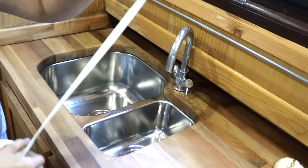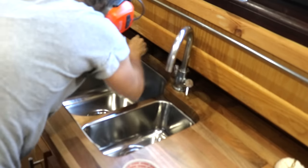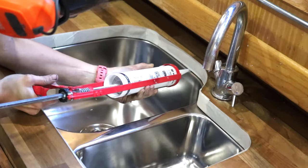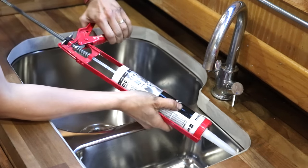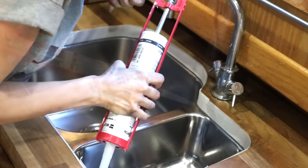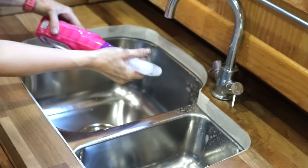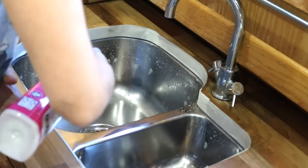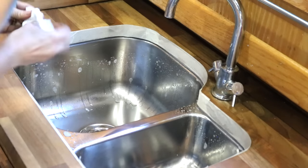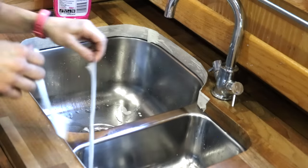I'm sure I'm going to get another debate like I did sealing my UPVC door. I asked online recently whether you would use clear or brown silicone - I had mixed answers and decided to go for clear because any messes get blended in. I made sure I masking taped everything, then ran a bead all the way around. I wasn't too concerned about getting it on the sink because once you've applied it, give everything a spritz with washing up liquid solution - then when you're removing all the excess, it easily glides off. Before it set, I removed the masking tape off the worktop and left it to set.